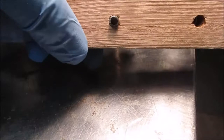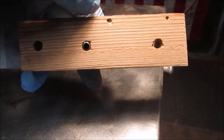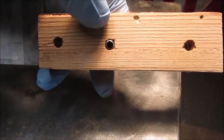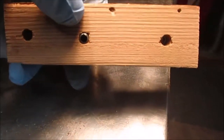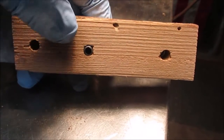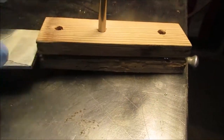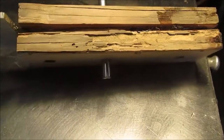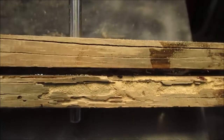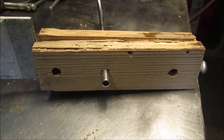This is set up good. We drilled our holes - see what you think of the hollow pins. We had a little bit of tearout but the more you sand, the better it'll get. These holes weren't exactly lined up - these two original holes weren't really lined up. I used my cobalt bits and just barely got through here because I took these holes from three-sixteenths to a quarter inch. If it wasn't a good bit I wouldn't have drilled through the steel. The only other choice is to heat it up, let it cool down and then you'll have softer metal. A lot of this bad spot is going to be taken off with the rasp.